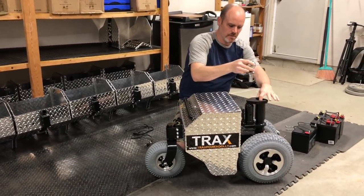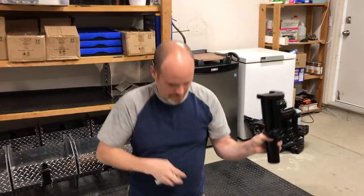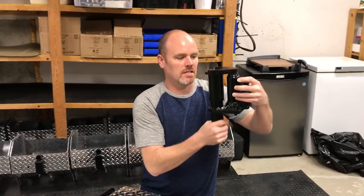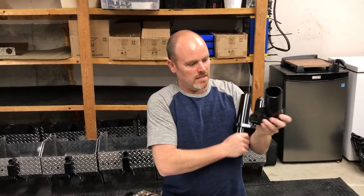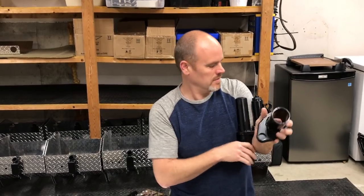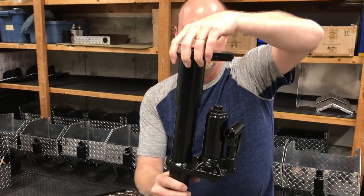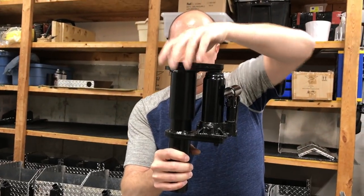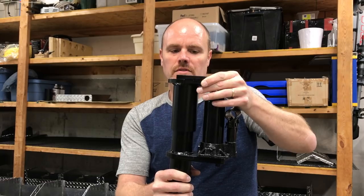The ball is simple — it goes into this, which is our jack stand. This is a removable item. You'll see this is a conventional bottle jack, and this piece slides up and down. On the end there's a little cup here that meets up with the bottle jack, so that cup goes on and will drop right in. The idea is you put the jack up and it locks up against the tongue of your trailer.